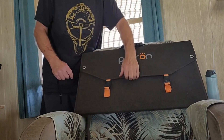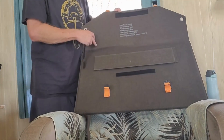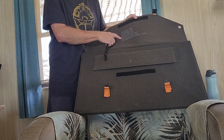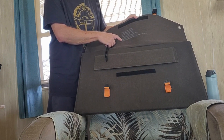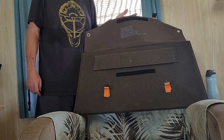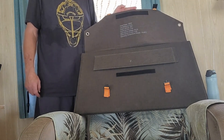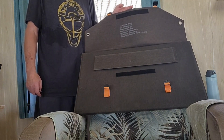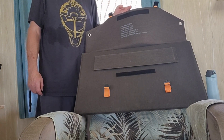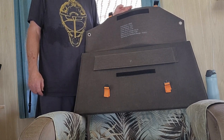What I'm testing will be the open circuit voltage, which should be 43.2 volts, and the short circuit current, which should be 5.8 amps. These numbers are obtained under optimum conditions. Right now, this being Florida, it's quite warm already around 9 a.m. Eastern Standard Time here on the Space Coast.